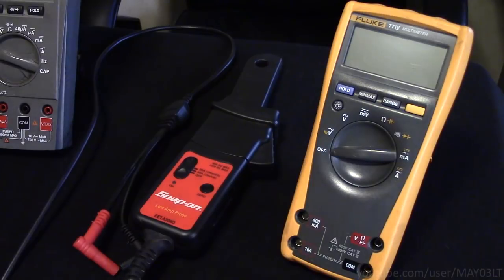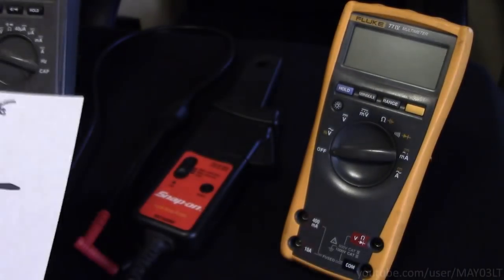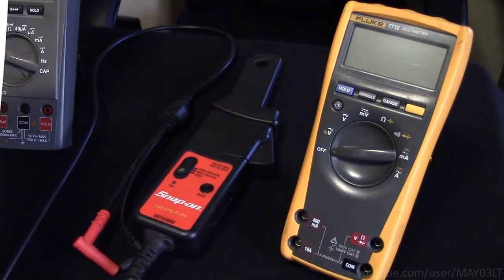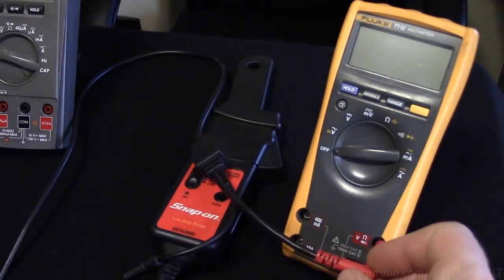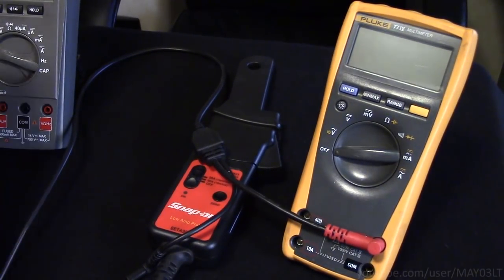The reason for going with the Fluke 77 was really because of the price — I got it secondhand on eBay. It does everything I want a meter to be able to do and it fits the budget. That's not to take anything away from the 504 or the TPI 183 or the 117. Here she is, the Fluke 77. Going down the list: it can do volts, ohms, it's auto-ranging, it's got a continuity beeper, there are no proprietary lead sockets — even my low current probe plugs right in. It's got the analog graph, we can do min-max, and it's got the dedicated millivolt setting for use with the low current probe.